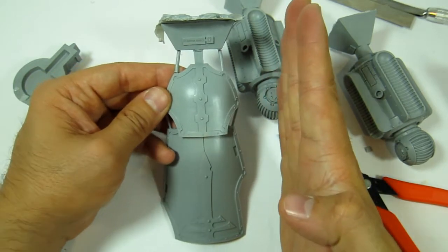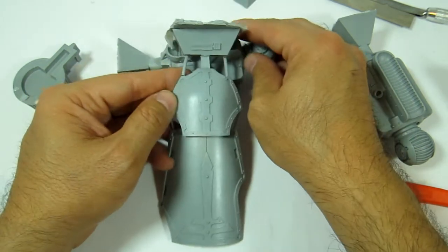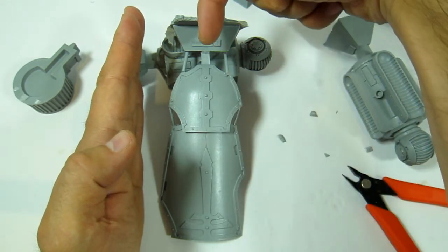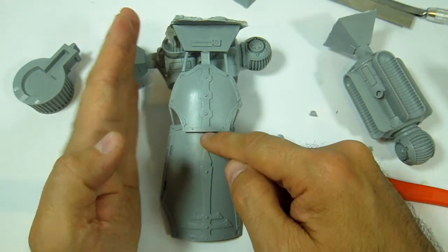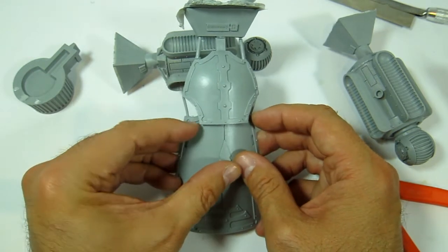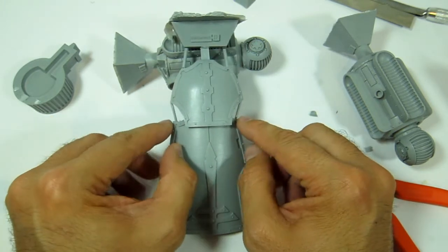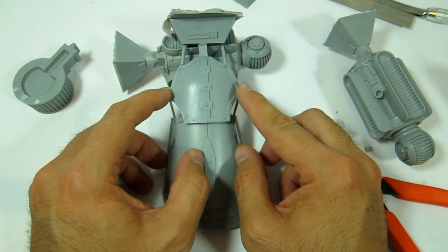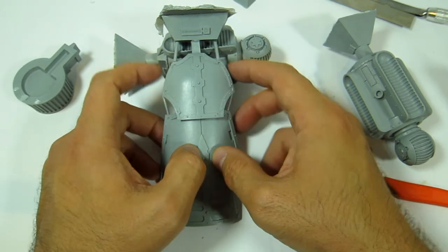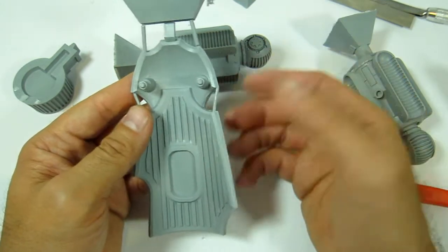this is basically a rectangular cubic volume, so it's like this. The resin is poured in through the top and it fills in from the bottom. Once it gets to here, if there are any air bubbles in here, they're going to have a hard time getting up through this shallow bit here. So they added these little air tubes, and the air comes up through here and then out through these air tubes as well as out through here. So hopefully that makes some sort of sense.